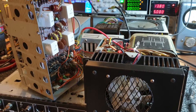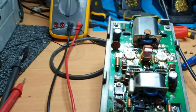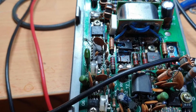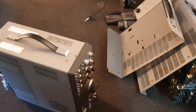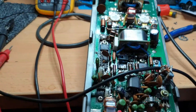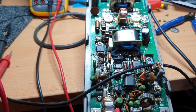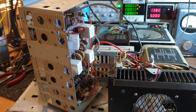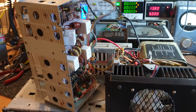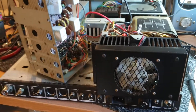Alright, thanks for having a little look at this. We'll go change that stage over and do a video of just the change-out of the stage. Hopefully the other stage is working okay — being that it's got a power supply fault in this one, the bad news is that sometimes a power supply fault will go over-voltage and take out this whole line — anything, so you can have really disastrous results when a supply goes bad. Your output stage is commoned up with the power supply. One very unwell TS-930S — it does have the antenna tuner but it doesn't work. Relays hanging out. 73s guys, all the best.